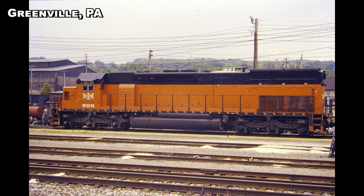The HTC truck looked superficially similar to the earlier FlexiCoil truck, but it was a substantially different design with an all-new frame casting, taller primary springs, stiffer rubber pads for the secondary suspension, slightly unequal axle spacing, and all traction motors facing in the same direction, which was the reason for the added length.